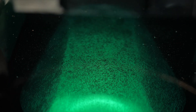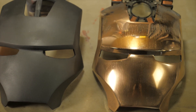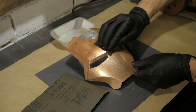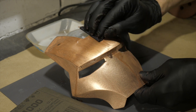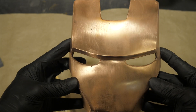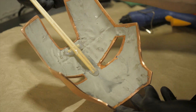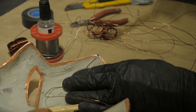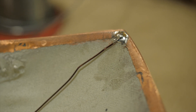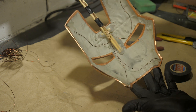Nickel fits well on a copper layer or on other metals, so if you missed the previous parts on applying the copper layer, check them out. When preparing the copper layer, it is worth considering that the nickel layer will be much thinner than copper, so the copper coating must be brought up to the quality and texture you expect to get in the end. After giving the surface the texture that suits you, glue to the inside of the part the rod on which it will be fixed in the galvanic bath. Then solder several contacts on the inside to evenly distribute the current over the surface. It doesn't need as many contacts as a graphite part because copper, unlike graphite, is an ideal conductor.